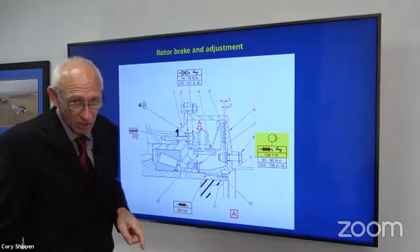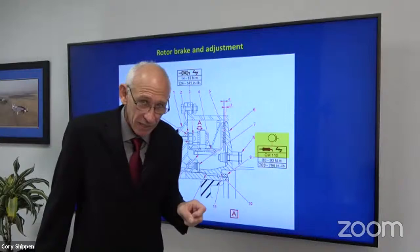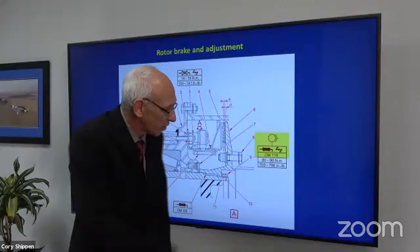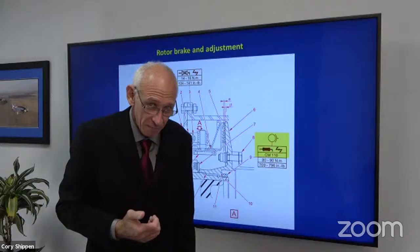This one here has a lot of things, right? It has this symbol, which if we look for it, is going to tell us that we have to add the drag torque. This is going to tell us that it's a wet torque or a grease torque. It's even going to tell us what kind of oil or grease we're supposed to use, and that's the torque symbol. So what all this means is I'm supposed to add grease to the threads, and we're going to see in just a second how much of a difference that makes when we apply it.